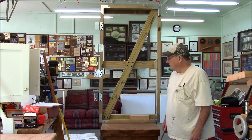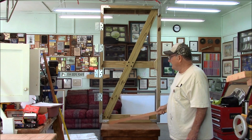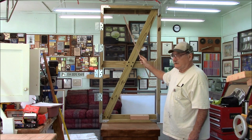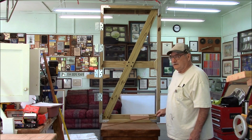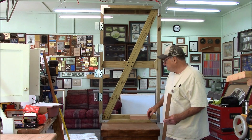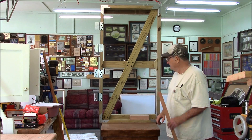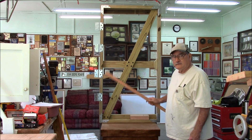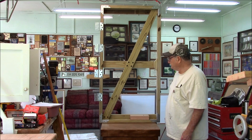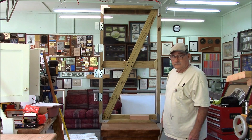The gate is a fairly conventional design. It's a simple box, 60 inches high and 33 inches across. It's reinforced with three horizontal braces that serve as spacers and nailers for the fence pickets. It's further reinforced with 25 black lag bolts, a 25-degree angle brace, and metal corner braces. The first thing we're going to construct is the outer box out of four two-by-fours. So let's get started.